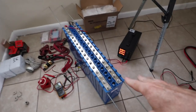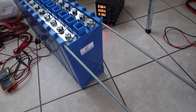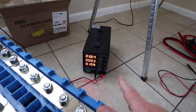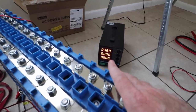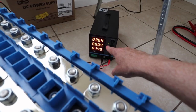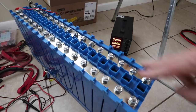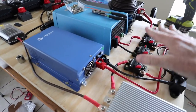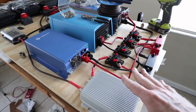It's several days later and this has turned out to be more of an ordeal than I expected for top balancing my batteries. I've taken this apart several times to balance the batteries — I found that these particular batteries you can put the threaded rods in and line them up really nicely. I ended up having to put this on a shore power charger to get the batteries up to full charge, since they were not fully charged when I purchased them. Now I've reached zero here — fully charged, we're at 3.64 — so I just need to pull these apart and measure the individual cells.